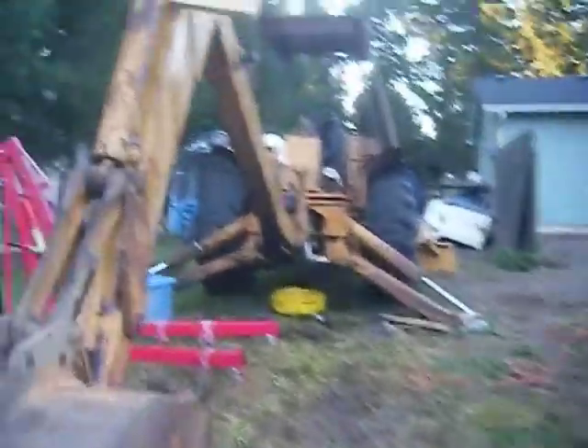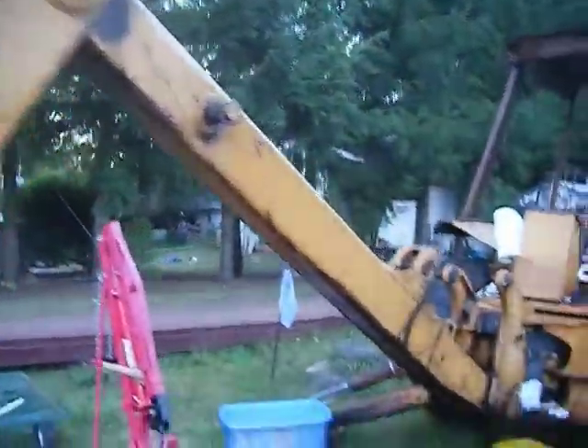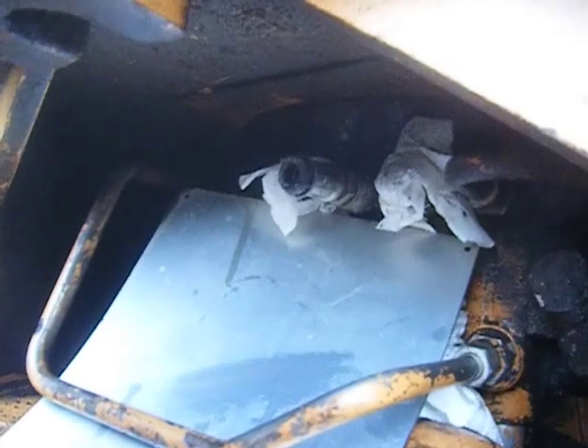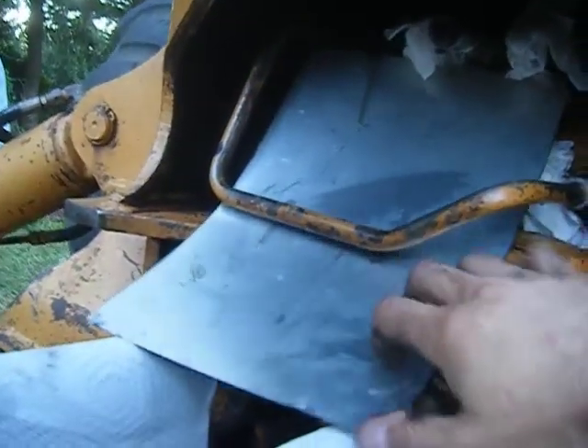I've got this fitting — I've got all the hydraulic lines off, including for the bucket, the dipper, the boom. The cylinders are out for being rebuilt and one hydraulic line is still stubborn. I've already cut the hose off, cut through the wires in the hose, sent quite a bit of spark. I've added this aluminum — it's actually a beware-of-dog sign, but it's aluminum and it'll be a little bit of a shield. Got the ports plugged. It's kind of rudimentary.